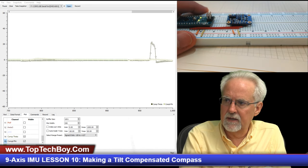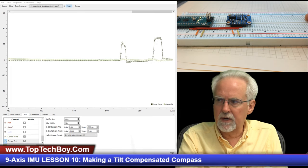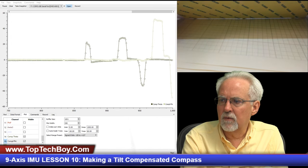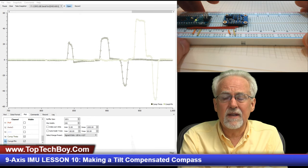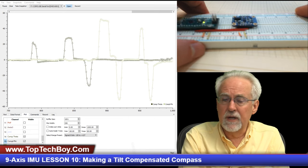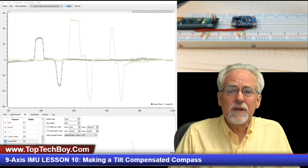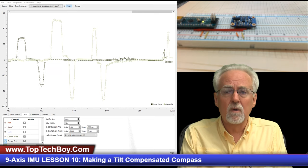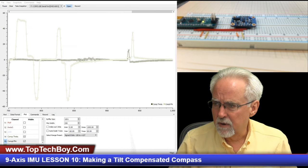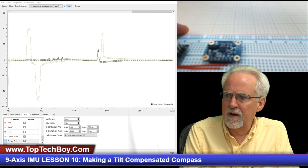Let me give you a quick demonstration. We can measure system roll. We can look at pitch — nose up, nose down. Do you see how responsive that is? I can roll right, back to flat, roll left. It is very snappy. The signal responds very quickly, but it's also pretty immune to vibration. By using that complementary filter, I have a pretty good approximation for pitch and roll for angles below 45 degrees. But at this point, we do not have any measurement of the heading.